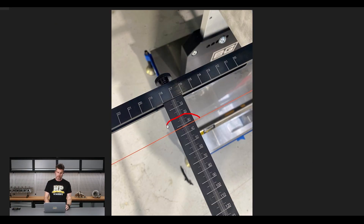When making these measurements and setting up our strings, it's really important to eliminate what's referred to as parallax error. That refers to the distance the string is above our ruler scale. We really want that string as close to the surface of the ruler as possible without actually touching it — if it's touching, there will be friction that affects accuracy. If the string is sitting 30mm above our ruler, that introduces parallax error, meaning if we aren't looking directly down on top of the string it can affect the accuracy of our measurement. Looking at it from an angle affects where it appears to intersect on our scale. So having the string close is important, and we should always make measurements by looking vertically down on top of the string.